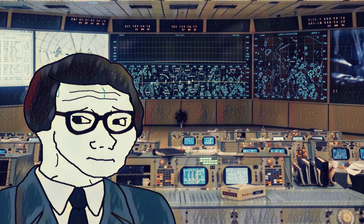Fuel cell one to main A, fuel cell three to main B. Fuel cell one back to main A, fuel cell three back to main B. Main A — three to main B — let's see what happens. Do we have instrumentation problems? It does appear we've lost AC bus two voltage. Main B is reading four volts, and that effectively takes AC two away from us.